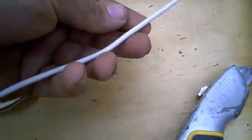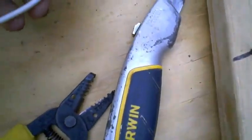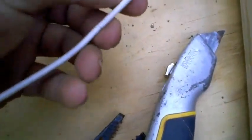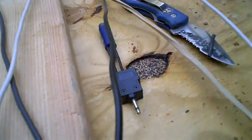What I've been doing here is, you see right there, I take my wire cutters and cut exactly where it says 12 gauge. I have two pieces, then take a razor blade down the middle right here. Then I peel this off like that, and then I bend it around the screw.